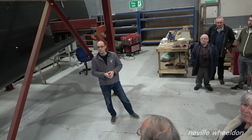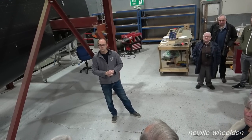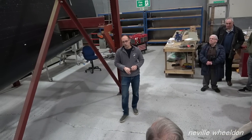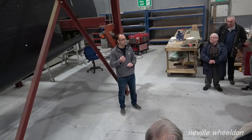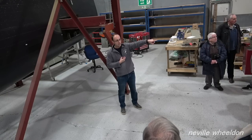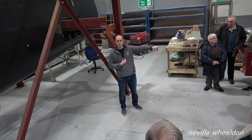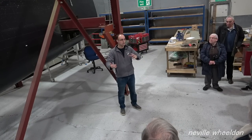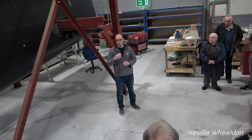Regarding the magnesium alloy rivets — no, we're going away from those altogether. We're going to use Hiduminium rivets, which are purple-headed rivets. On NX664's wing behind you there are some magnesium rivets put back in purely because we had a big stock of them and for cost saving, and since that aircraft isn't going to be airworthy that's acceptable.